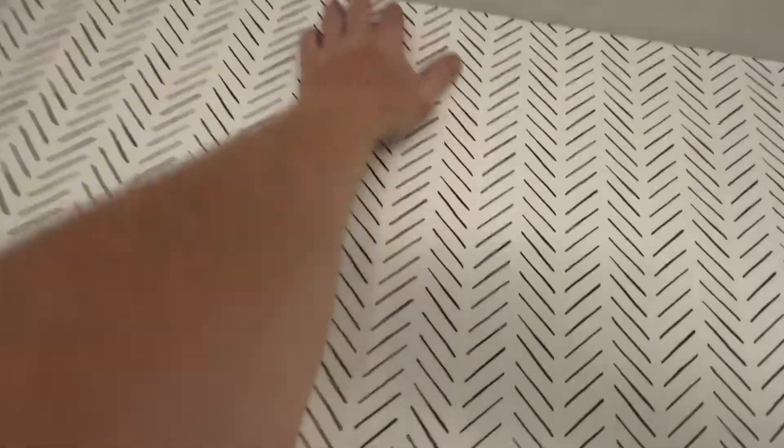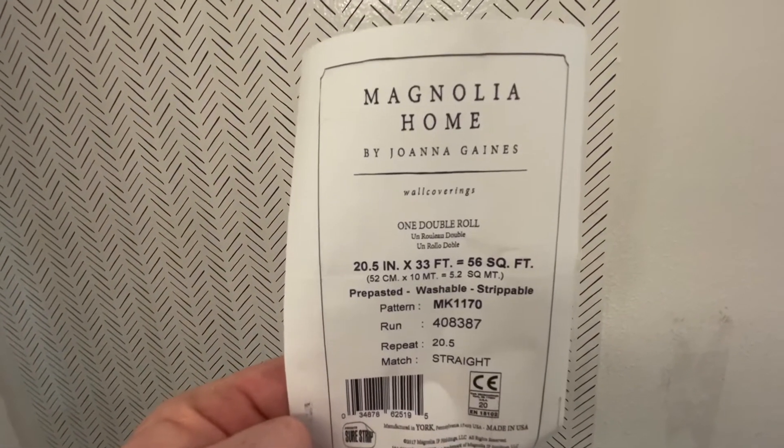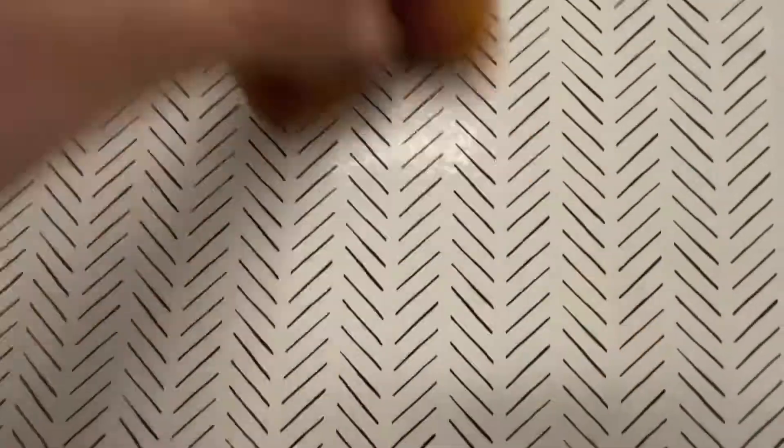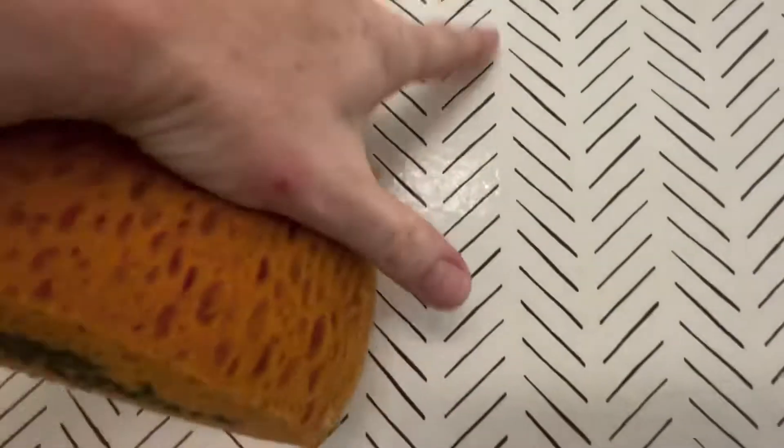The seam is wet — if you can see it, it's because it's saturated. This is a name-brand wallpaper that probably costs about $80 a double roll, which gives you three sheets per roll. Look at the beautiful wallpaper you get. Just because the ink comes off a bit, don't think it's cheap — it's not. Go around with your sponge and sponge off the color. If you see a little wrinkle from expansion, don't go crazy — just push it down. If you have a little bubble, let it go. It's thin stuff; the air will pass through it after your wallpaper pulls tight against the wall.